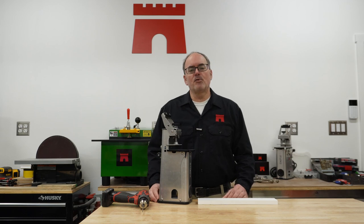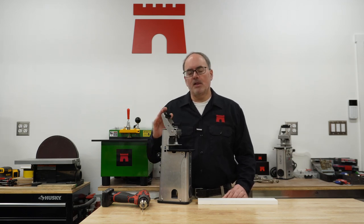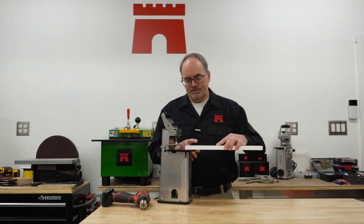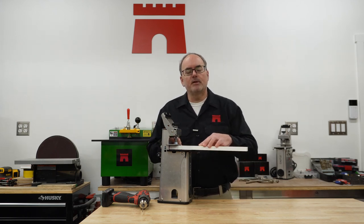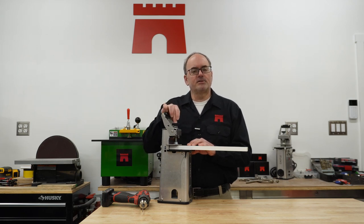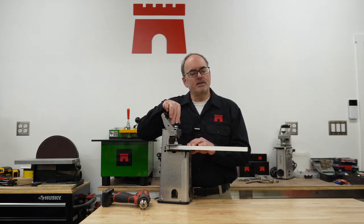Let's set up a 3/4 inch piece of stock. With our clamp lever in the material loading position, we're going to take our stock, place it on the work deck and underneath of the clamp plate. If the clamp plate is too low, we want to turn our stock thickness adjustment knob counterclockwise until we have